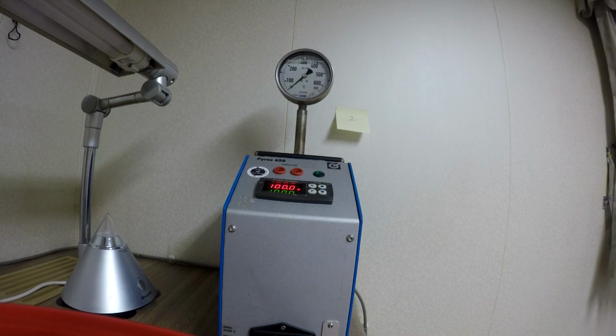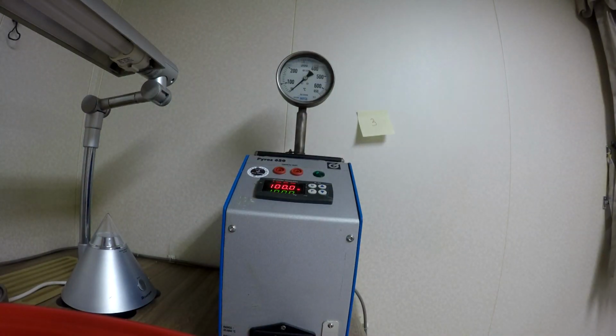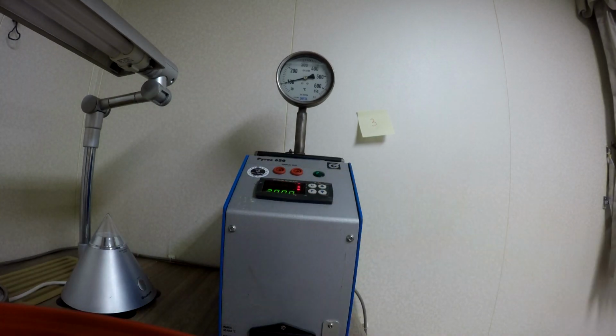This is very, very important to check in all ranges, because the generator, as we know, at the start of the engine works at about 10 to 25%. This is also when the washing procedures of turbochargers are done. The best working conditions for the engine are at 75% of the maximum output. We have better flow of the exhaust gases, better scavenging air pressure, and this is the point for which all the engines have been designed.